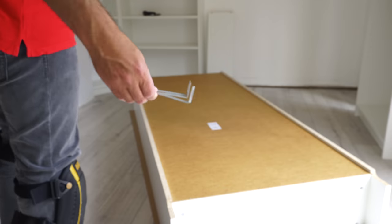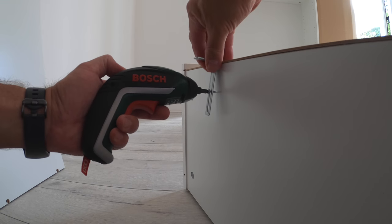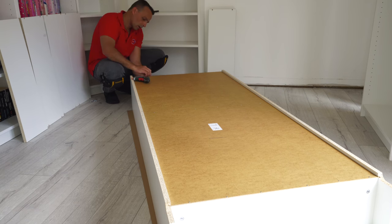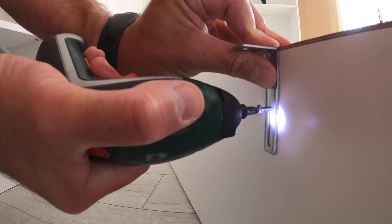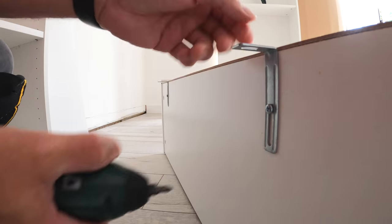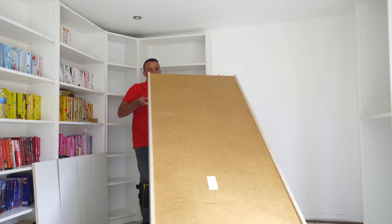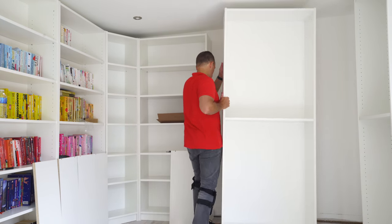Now secure the L-shaped wall brackets right on the edge. I'm not using the washers provided because the screw heads are bigger than the hole in the bracket, so the screw can go slightly further in without them. You can push the brackets slightly outward because the side panel sticks out a little from the back. Check that your ceiling is high enough — if it's too low you'll have to build the bookcase upright. The bracket lines up with the back panel but can be pushed slightly out, especially if you have a skirting board.